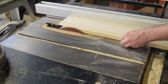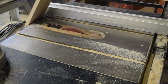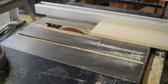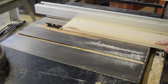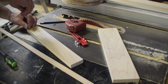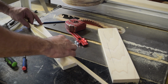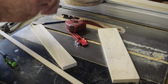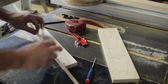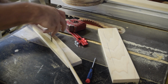The two front rails, top and bottom, on the front of this bookcase are going to have a curved cut at the bottom. So what I'm doing here is I'm cutting a thin strip that I can use to draw that bend or that curve in those rails. Now to make this curve, I'm just going to put 2 screws in each of the bottom corners of these rails where there's just enough meat for those screws to hold without cracking my poplar. And then I'm going to take that thin strip I made and pull it towards a mark I made 3/4 of an inch up in the center, and then I'm going to draw my curve.